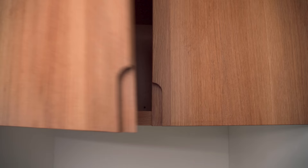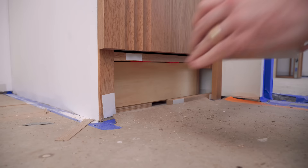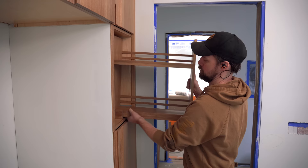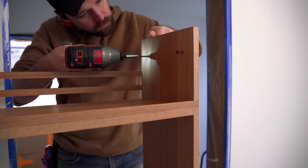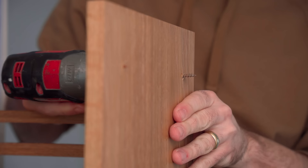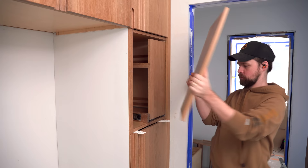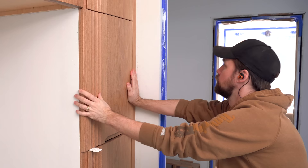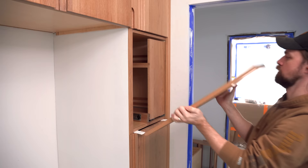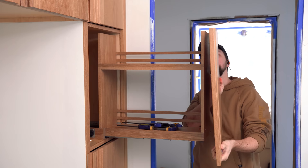Back in the house, I can finally test out these doors, see how they fit - I'm so excited about this, I've had this design in my head for months and it's so cool to see it come together. I temporarily attached the toe kick with some double-stick tape just to see how it looks - I'll remove this before we tile the floor and then it will go on top of that tile. For the most part it's really easy to install these doors except for the center one, which is going to be the pantry. That one takes a little bit of doing because it has a fully enclosed door front, so I added in four screws before the door front went on and let them poke out a little so I could mark the cabinet. I then put spacers underneath the cabinet door and pressed it into place - those screws leave indentations on the back, and then I can take it down to the floor, pre-drill them, and connect them. With that, the cabinet face is done.